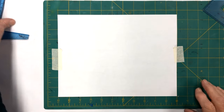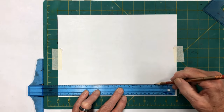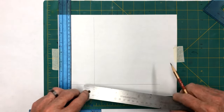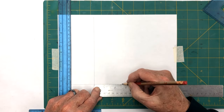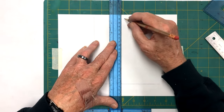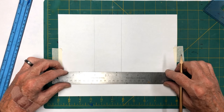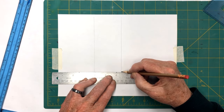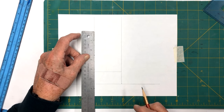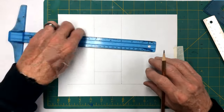We're back with a clean sheet of paper. This is a rough drawing we're going to build these on. We'll do our baseline again, give ourselves an up line, and measure out two and nine-sixteenths — that's a sixteenth bigger than a half inch. That'll make sure we have room when these go together so the solar light will fit in the top. Across the top, we're going to have a header. This ruler happens to be an inch and a quarter, and that's the size I want to make my header. The overall length is going to be about five and three-quarters — that gives me a nice feel.